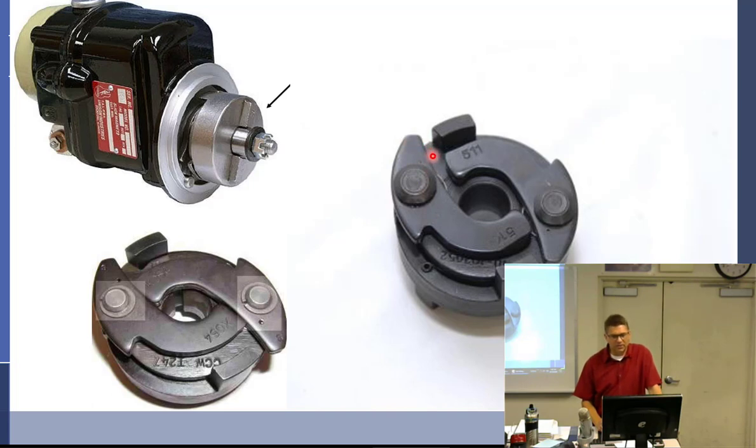And so you can see that right now the cam assembly, it's called the cam assembly, is touching right there. And so this is going to pop out, and there's a pin right about there, and this is going to catch on that pin, and it's going to stop the magneto from turning. Magneto absolutely stops, but the engine keeps going.